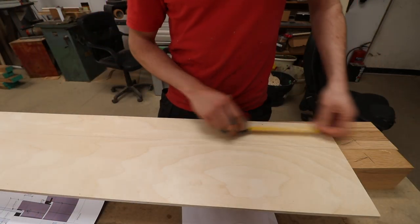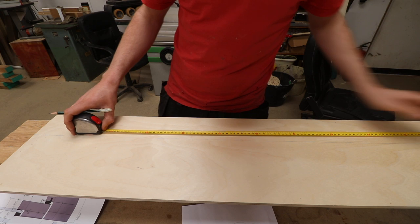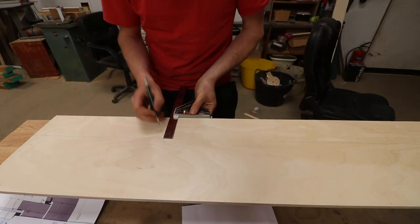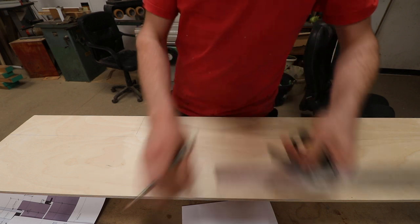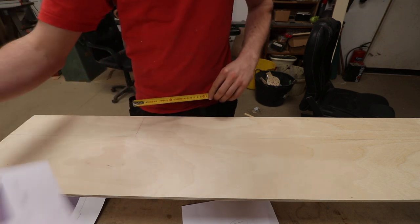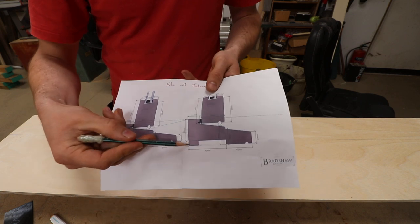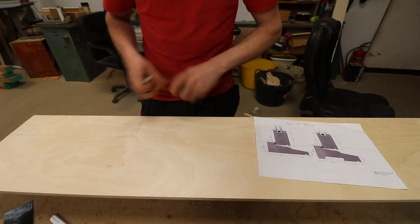I'm just going to use the end of the timber for the top of the window, and then I'm going to mark out full size that we're going to be working to. So it's 1055, it's the height of our window. So that is our brickwork or finish height of our window. So let's draw, like we did on the sill, the sections of timber that we've got. So on the sill, where's our cross section so we can refer to it? Here we've got that 12mm piece of timber, then the 58mm section of wood to make up the sill. So let's draw them on.